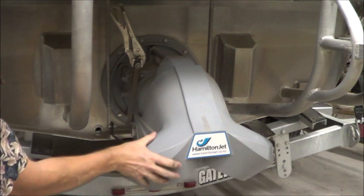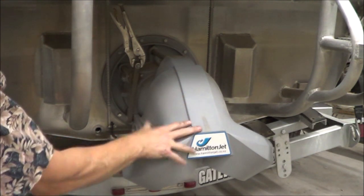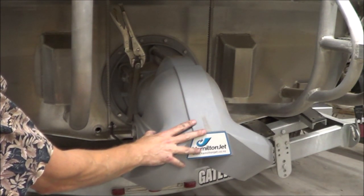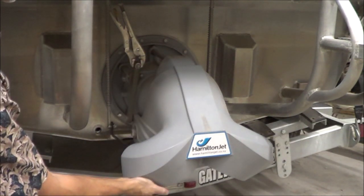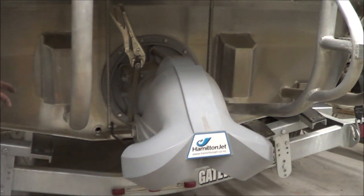So probably that's what was happening in the original design: you're having a guy in reverse, the bucket jiggles around a bit, and all of a sudden, boom, in a heartbeat, he's in full forward instead of full reverse. Which is bad, so they create the brake box and all the problems that happen along with that.